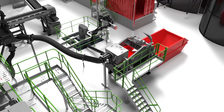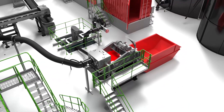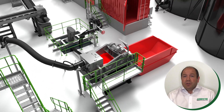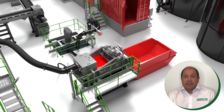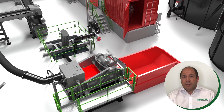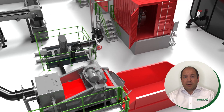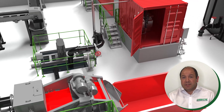I'm going to give you a quick overview of this part of the plant as David will follow with more detail later on. In wash recycling, due to the typically high levels of organics and lights, the wastewater is first passed over a trash screen which captures light floatable waste. The remainder of the wastewater is collected in a sump tank — in this instance a ground sump.